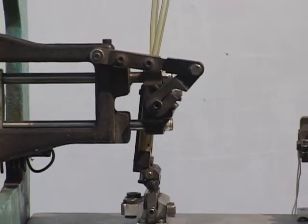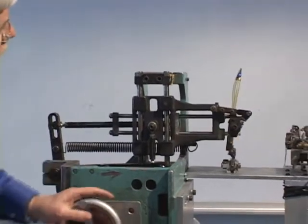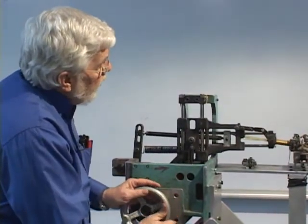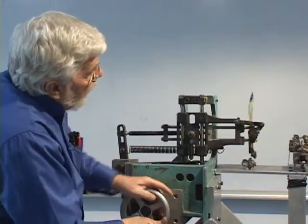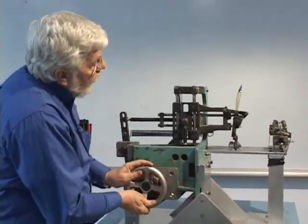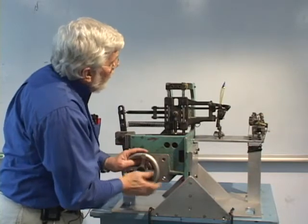It's of that class of mechanism. It's a rather complicated pick-and-place mechanism, if you think about it. I've got these two slides, a lot of parts, a lot of bearings, and one of the issues with this particular design was vibration, because we have some rather long links hung out cantilevered away from their supports. And when you start to run this at high speed, you can imagine you're going to get some vibration issues at the end effector, and that can cause it to not be in the right place at the right time